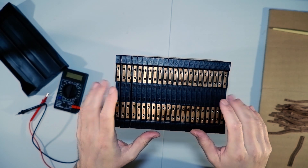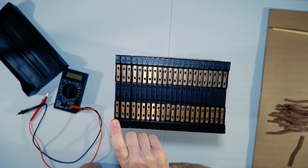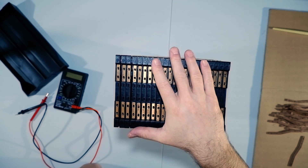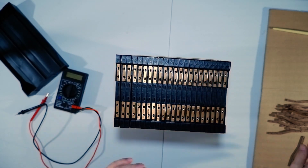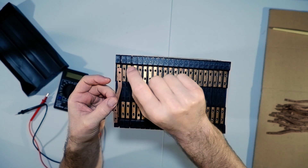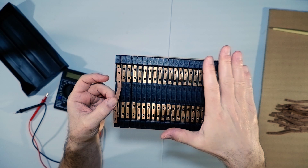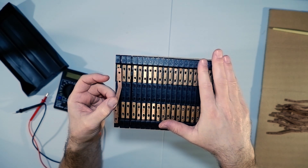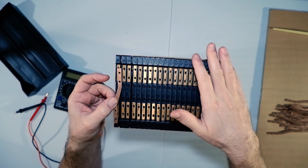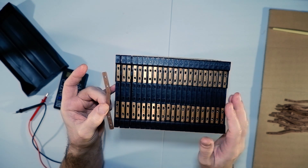So this is going to be a 22-cell pack. The cells are 20 amp hour batteries, so it'll be a 20 amp hour pack but with 220 amps maximum. The good thing about this is with these bus bars going all the way along - I think they use M3 bolts to bolt it all together - I won't have to do any spot welding or complex battery pack building. I've ordered a BMS to go with it - I'll insert a picture of what the BMS is.